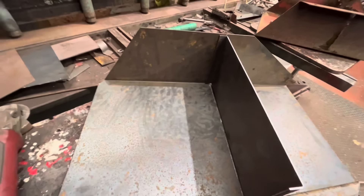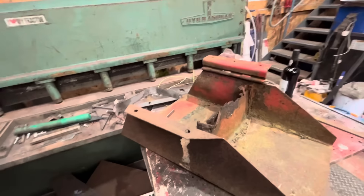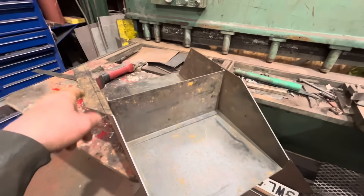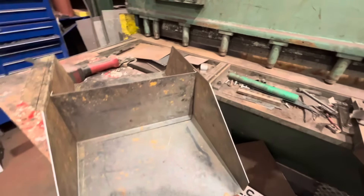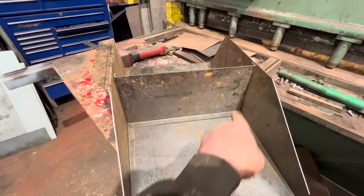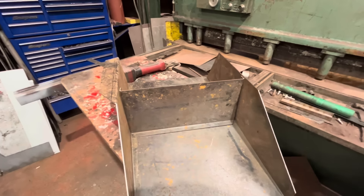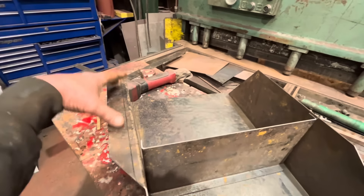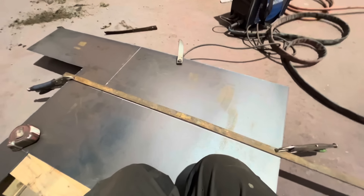Or as close as - well, even if I say so myself, I think I've got that pretty damn close to that. No rusty bits in it. Obviously we've got a few holes to get marked and drilled, that hinge to come off and free up and fit on there, then we get this tray welded in, and then offer it up and see if it fits. I think we'll get the hinge on fitted - at least bolt it on - then we can definitely line up where the hole's going to go for the studs on the chassis.